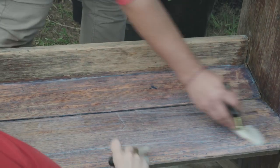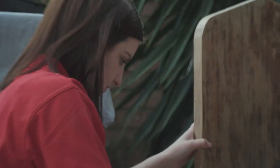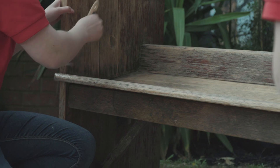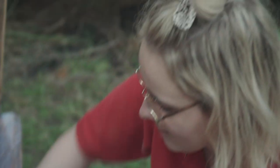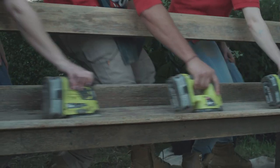When you're painting and varnishing something you want to make sure that you varnish first and then paint second. Do one coat of varnish, wait for two hours for it to dry, sand between each coat, do another coat, let that dry for two hours. After the first coat of varnish you want to use a nice light sandpaper to sand between each coat — that will help the two layers stick together.